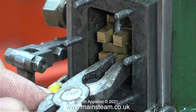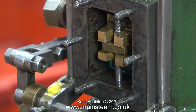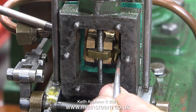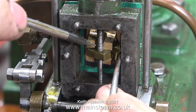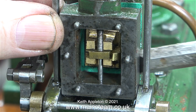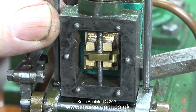As usual it's down to bad workmanship. I could make a new slide valve but that's not the point — this is a restoration, not a rebuild. Thankfully I have a simple solution. I'm going to fit a shim behind the driving block which will hold the valve slightly closer to the ports. The idea is not to wedge the valve against the steam ports; it's just to move it slightly closer.